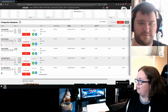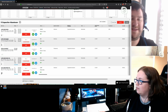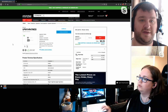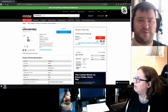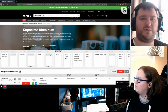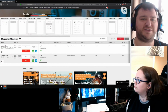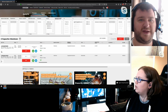I was using it because of the free shipping. I'm just automatically going with higher ratings than what it says, and I'm putting the one that I got in parentheses. So like 2200 microfarad, 25 volt, and in parentheses 35 volt, because that's the one that I just ordered. If you've already done some, just leave it as it is. But any newer ones, yeah, I would. I'm just so used to, in my brain, things that are built for higher voltages being slightly less temperature sensitive. It might not be true though.